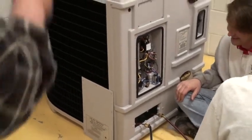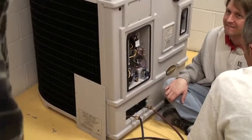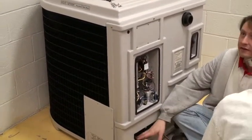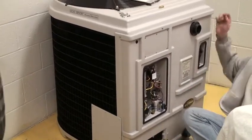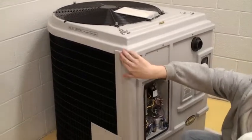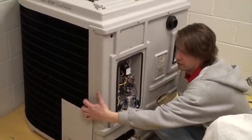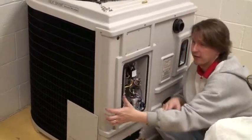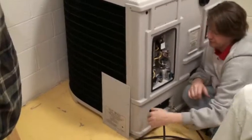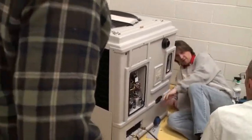When you have older units, how do you recommend you change the thermostat capillary down there, on the old ones? On the older ones, I take this, and this. Then the bottom two, I usually leave this one in. Take the whole front off. You can peel this back. Since it's plastic, it'll bend a little. You can peel it back enough to reach all. And seriously, I'm laying on the ground with my arm all the way in, and I'm feeling it.